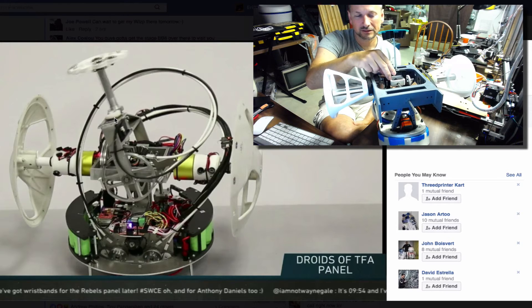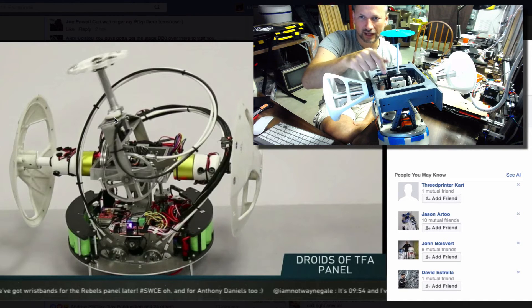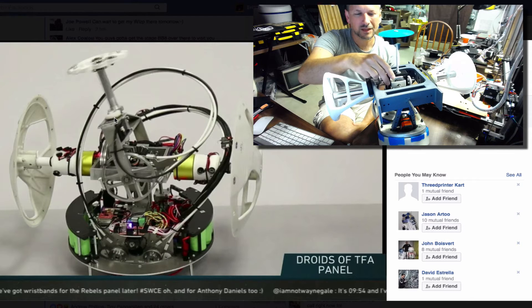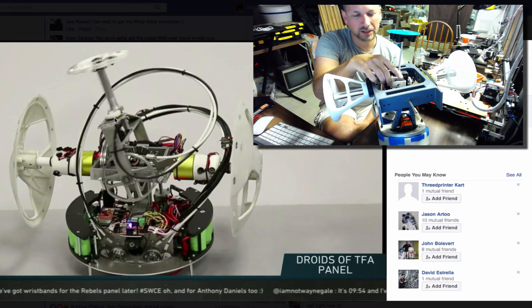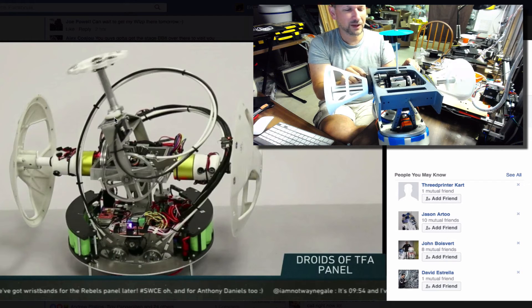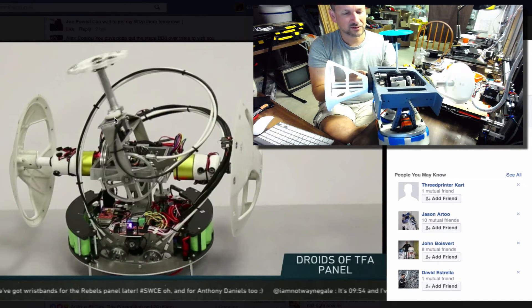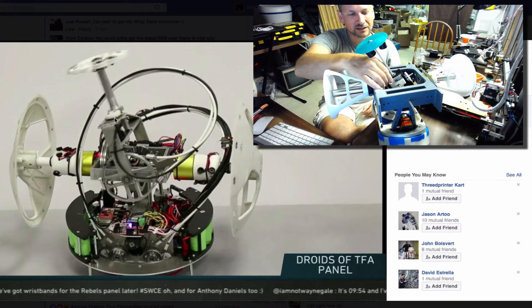My drive mechanism is a little bit different in that I'm using a differential split — not just controlling an X axis and a Y axis independently, but controlling the two together. I could split it out and do it the way they're doing it. But right now I want to see this one through, because it has the extra benefit of the motors themselves being their own counterweight, allowing everything to be on the pendulum and fairly compact. I also have a little three-ounce counterweight at the bottom right now that helps keep things balanced.